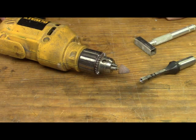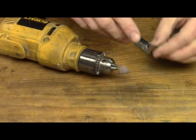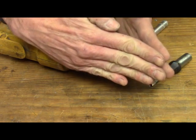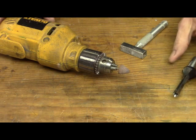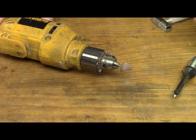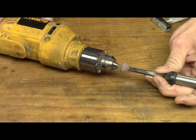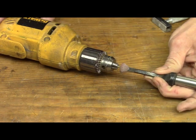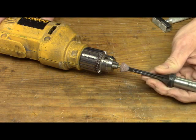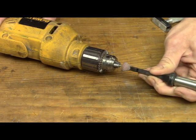The chisel also has to be sharp, and to do that you need a cone-shaped sharpening stone — this one comes from Dremel. As it came from Dremel, the angle was steeper than the grind on the end of the chisel, so I needed to modify it to match more closely using a diamond dressing wheel. To sharpen, you put it in the end, get one of the points facing right up toward you, raise up on the end of the chisel until it just rubs on that point, then turn the drill on. This isn't a gross material removal — just refining a little bit to get it sharp. Continue that for all four points of the chisel.